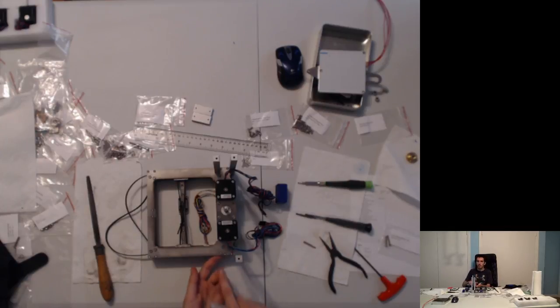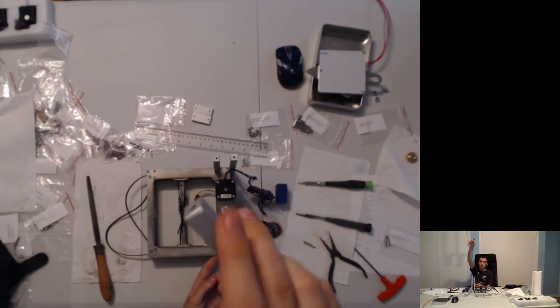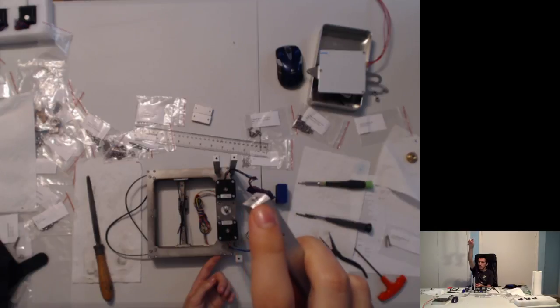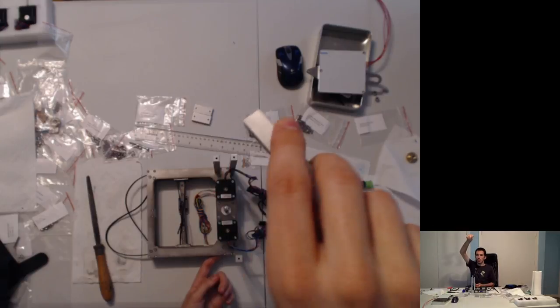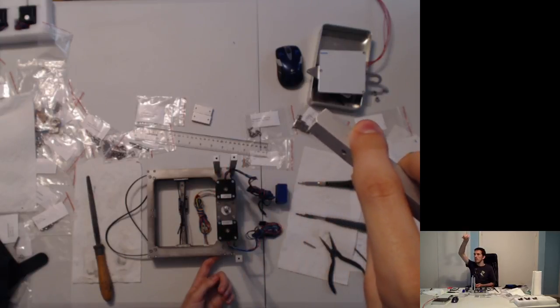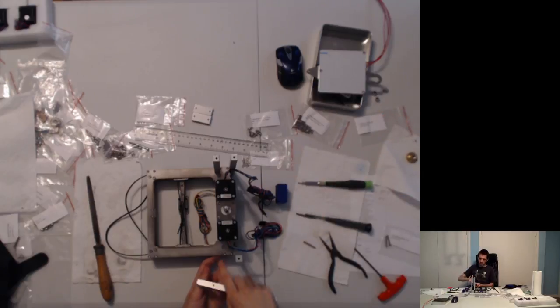So with the pillars, there's a screw here, and then right next to it is a screw head, which is interfering. So what we've done, one of the things is, let's see, visibility. I think you can see it. We've put a bit of a chamfer on the one respective corner of the pillar. And this is so that the screw head does not push up on it. This is so that we clear the screw head.